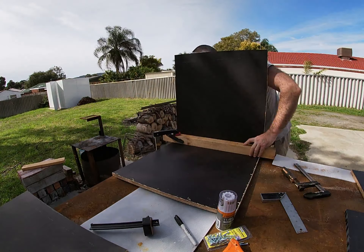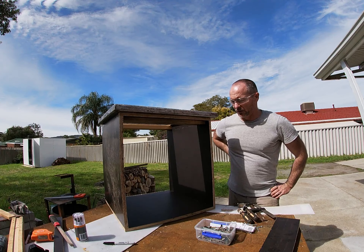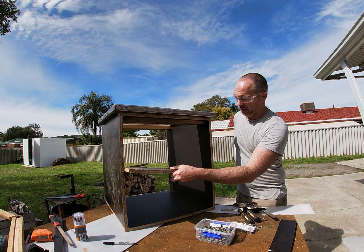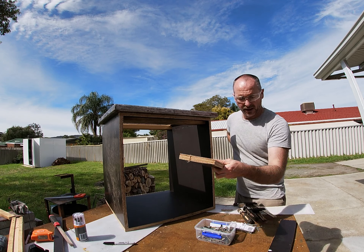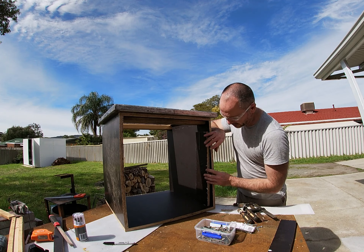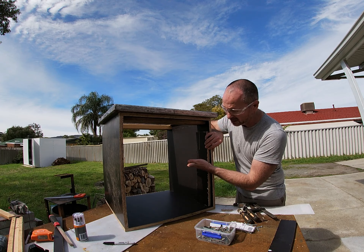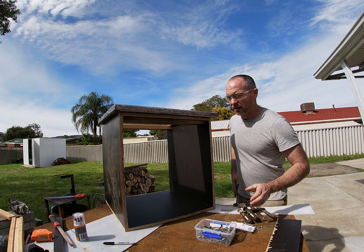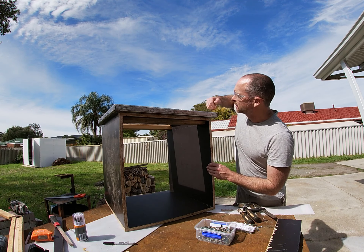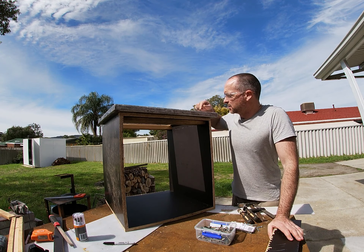Got to get the screws now and put it together. So what I'm going to do on this project is use new screws. Last project I used all my recycled ones, starting to run out of good ones, so I'll use new ones. But because I'm trying to pull this timber onto that timber, I'm going to use a clearance hole. The hole's got to be bigger than the shank — that's a 5mm. So I'm going to do it properly, drill clearance holes and pull it right in. No pocket holes though — they're still banned.